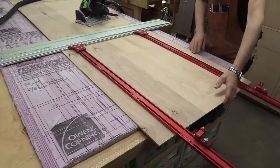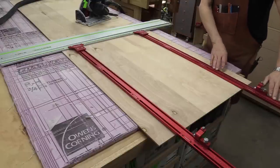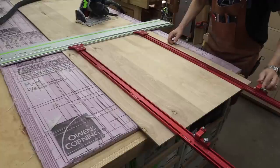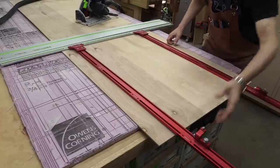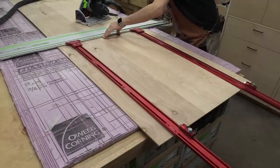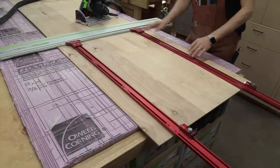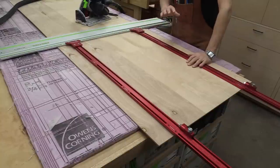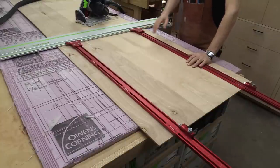Now with this edge perpendicular to that edge, I've added two more scales to each side and set the flip stops to 44 and 3/8 inches, which is my final measurement. I'm just going to butt those right up against that and make the cut. I'm cutting just one piece here, but if you're cutting multiples and need repeatability, this is a great system.